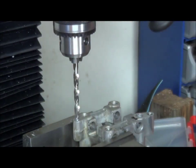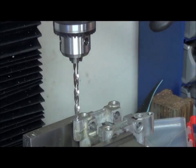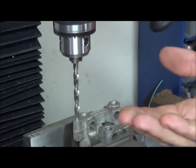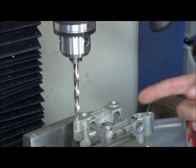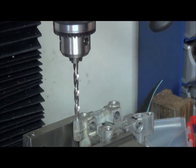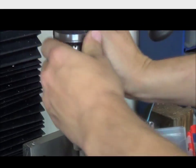The reason why you want to drill out all the threads, even though a helicoil is only about eight mil - well, we've got seven threads. The reason you want to drill out all the threads is because when you have your helicoil at the top, if you have threads at the bottom that are mismatched, the bolt will want to grind up and chew chunks, and it might make this damage happen again. That's exactly what we don't want. So we'll change this out and stick with tapping.